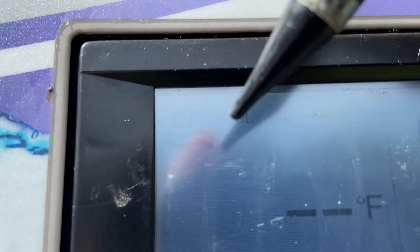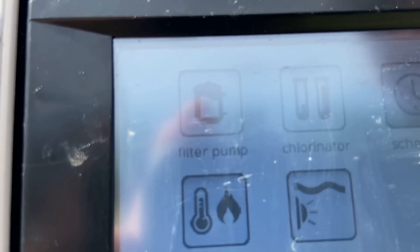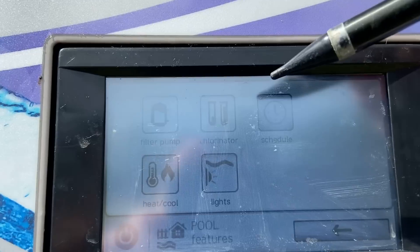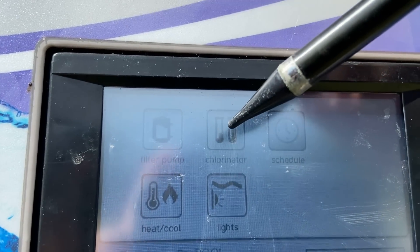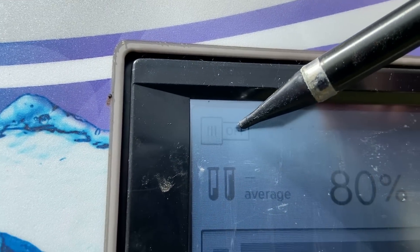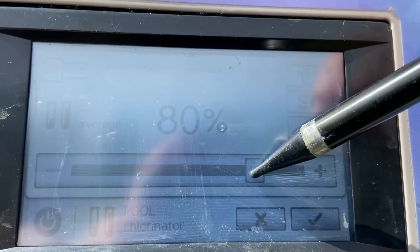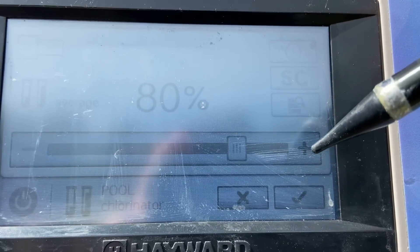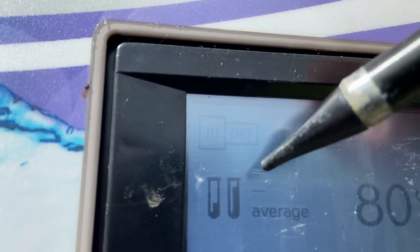As a cleaning technician, you're not going to do anything in spa ever. Use the arrows to switch between pool and spa. When you switch to pool in the top left corner, click the screen and you'll see the different options available. This particular system has a salt cell. Here's your main pump — I have it off right now. The salt system percentage is where you go for the chlorinator. You can change the percentage here — 80, 100, whatever you want — and click the button.